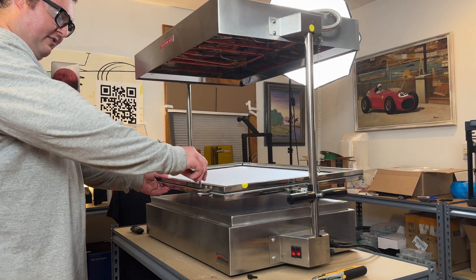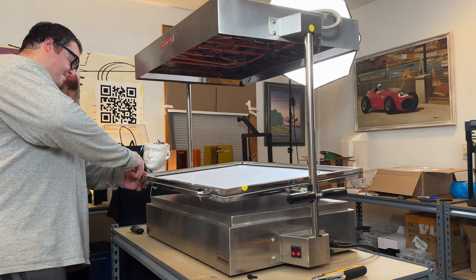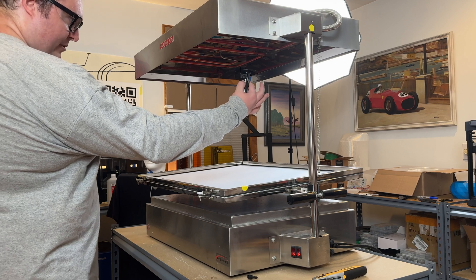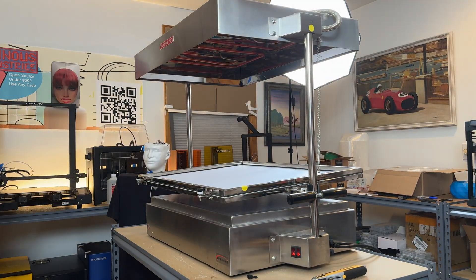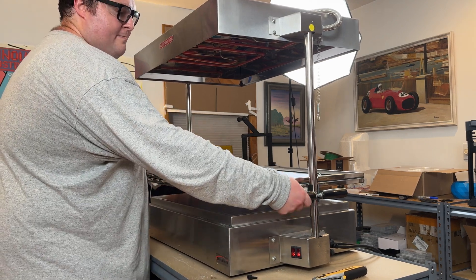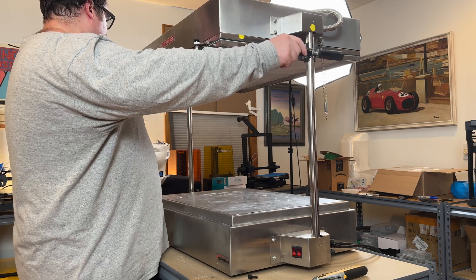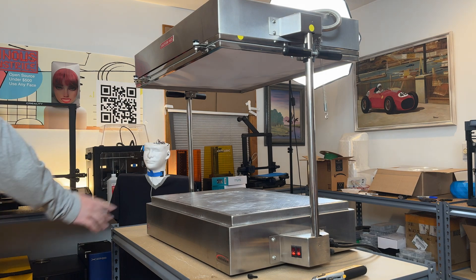Once the plastic's in — I do apologize for the low camera angle, but I don't have a high tripod. Once we tighten this hinge here and that's done, our plastic is ready and it will be sort of airtight. Right, you can see where my hand is — that's about 250 degrees Fahrenheit, so very hot. You can see why plastics like PLA don't really stand a chance. The next thing I do is move this frame up with the plastic in it. These handles tighten and loosen in a corkscrew manner, so you can tighten this and that will hold the hinge in place.